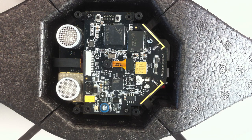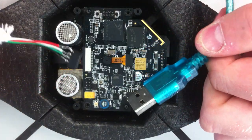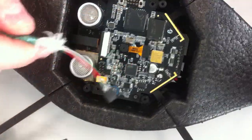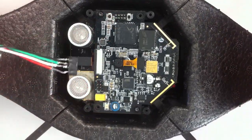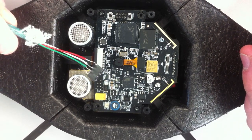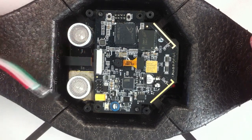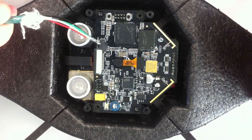There's plenty of information online about it and I can do a video on how to do that later if there are questions. But essentially it involves making a USB cable. This one is fairly simple — I just cut up a USB lead I had at home, followed the wiring guide available online, and made this little cable. This one's a bit rudimentary and needs some epoxy, but as a get-out-of-jail card for these drones it works great.